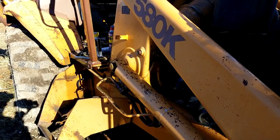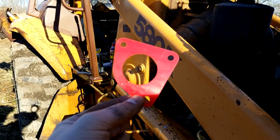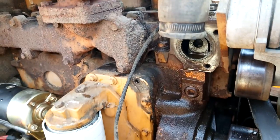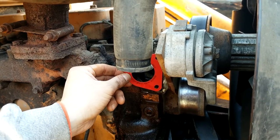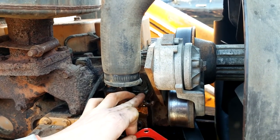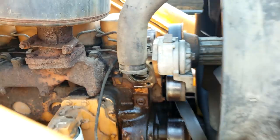Thankfully we're in the home stretch. One thing you will find in the instructions is this little template — this is just to verify that you have clearance in order to line everything up with the new housing. What you do is put this template up against the housing where the thermostat sits. If this housing has a diameter more narrow than this template, then you've got to shave some off to make everything work. But thankfully, I'm not in that boat.